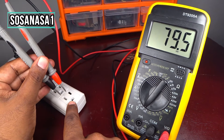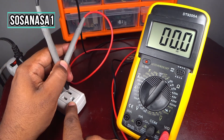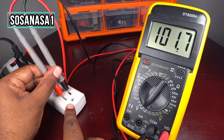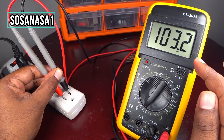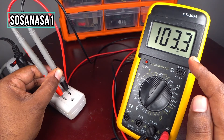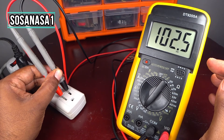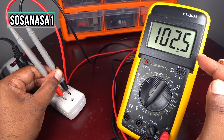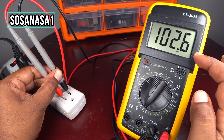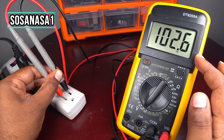For example, I'm going to disconnect this and change how I connect the probes. If you watch on the multimeter screen, we are never going to see a negative number, because in alternating current voltage we will always see positive numbers.